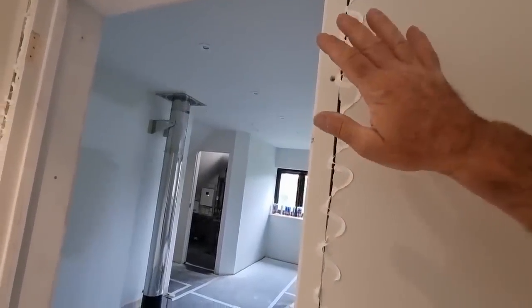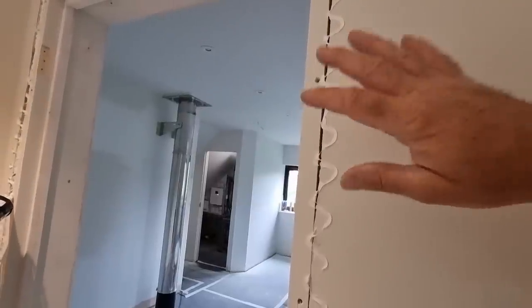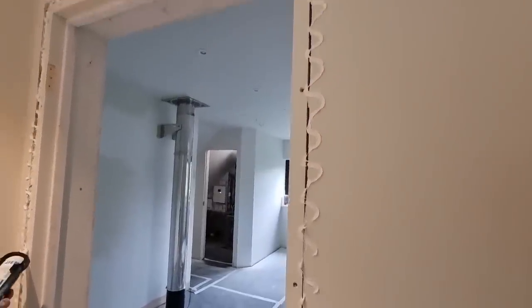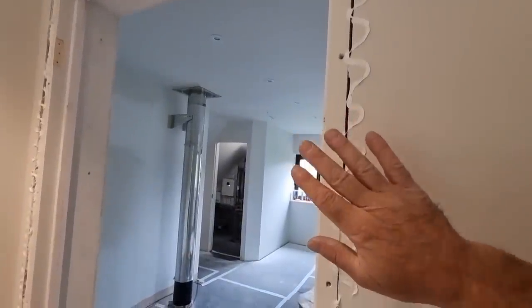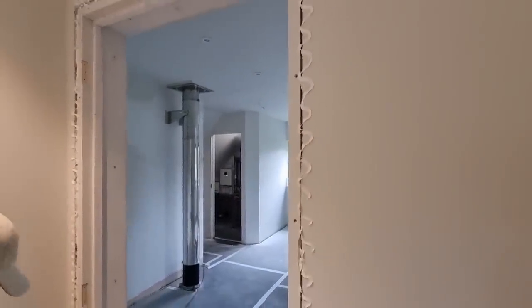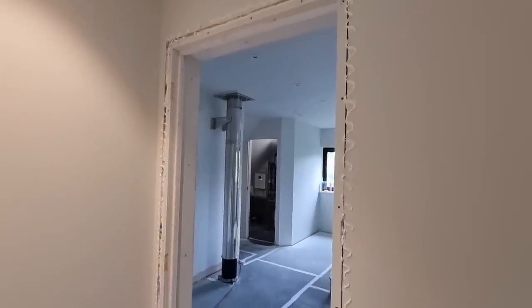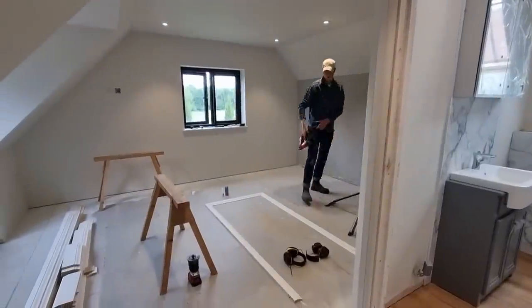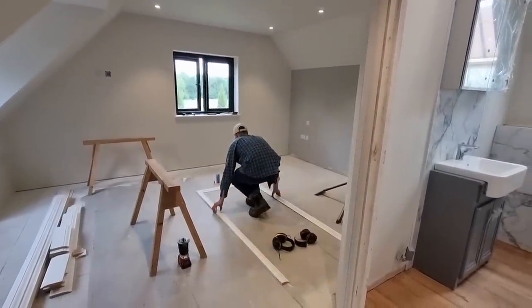You just push everything against it, rub it a little bit, pull it off so it sort of springs apart, and then push it back. So that's how you deal with that if it does skin. If you just push it against the skin, sometimes it just doesn't suck in to the material, especially if it's an MDF. So this polymer type adhesive is a much nicer option because you can end up with it grabbing as you need it. So this is the bit you have to be careful with.